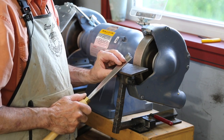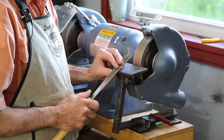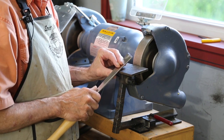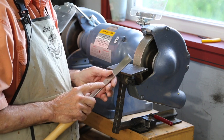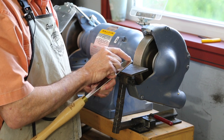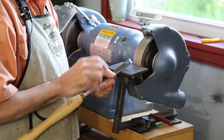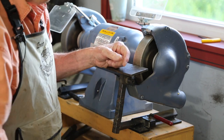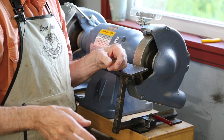Colwin Way's chisel works on somewhat the same principle — by wasting the tool, that is putting a waist down in here and having it narrow, you're bringing that contact point closer to the area where the center of force is. So better stability is the reason all of these work a little better.